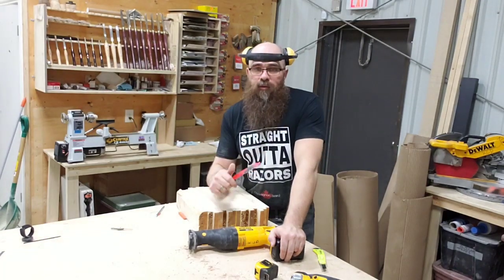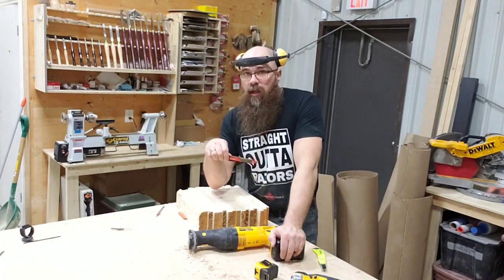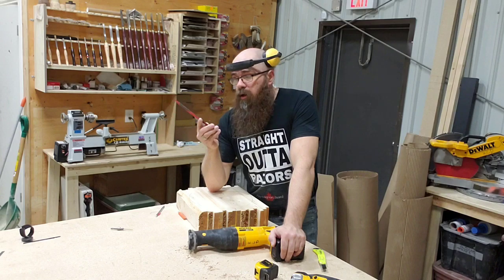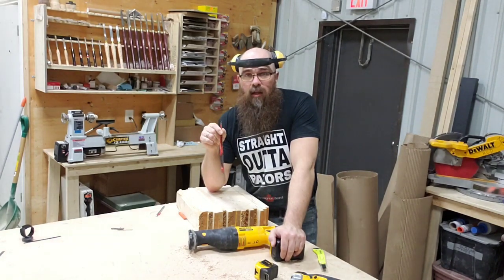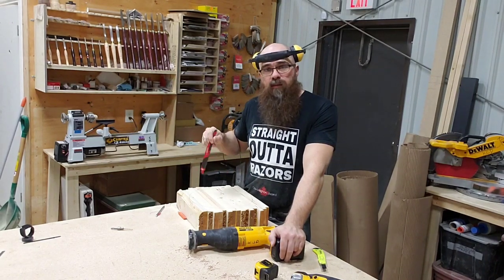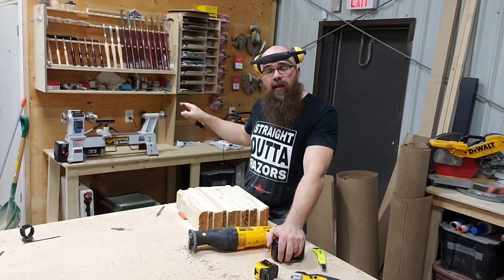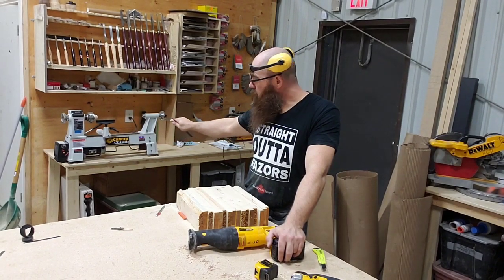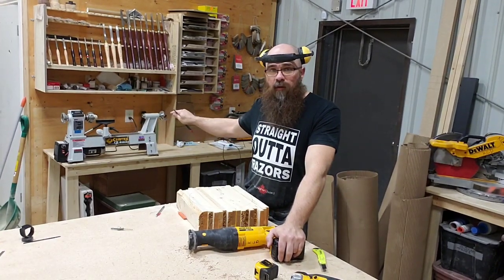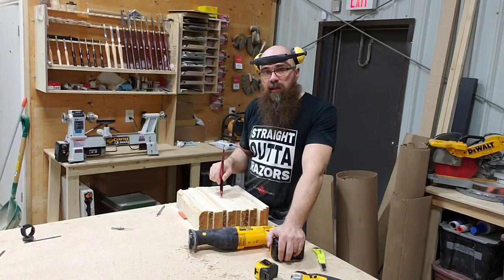It's not going to go all the way through our blade or all the way through our block, and that's not going to be safe. So I'd rather just take like an 8-inch sawzall blade and use our sawzall and just nip off the corners as much as we need, being as that's 12.5 inches from our tabletop to the center of our drive, and we're making this 11 3/4.